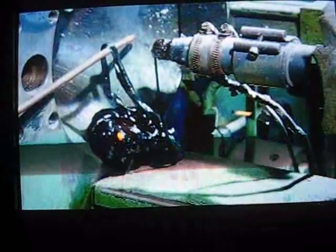They feed polystyrene pellets to an injection molding machine, which melts the pellets into a thick paste. The four sections of a mold close and nozzles pump the plastic into it. It oozes into all the grooves and hardens almost instantly into the shape of a train car. Then they clip off excess plastic.